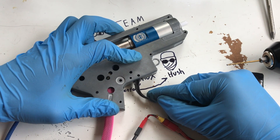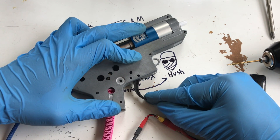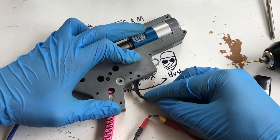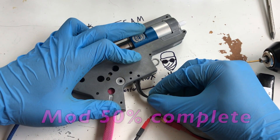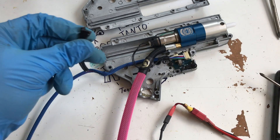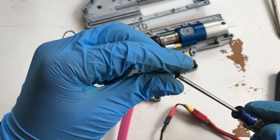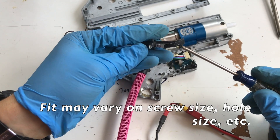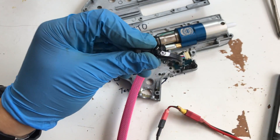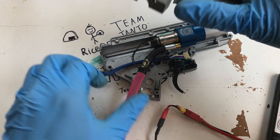When I pull the trigger and the solenoid goes off, the trigger is not letting me go back any further — watch. See, it's not letting me go back any further. I'm literally shaking the table, I'm pushing it. Now all we need to do is adjust the slack right here and the trigger should be just good. Open the gearbox back up and now we're going to use the top screw. I've lucked out on this trigger and don't need any modification, so I can just screw this one in — just like that. Then I'll put it in and close the gearbox.